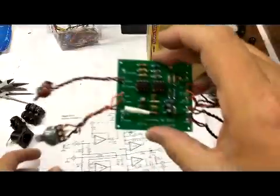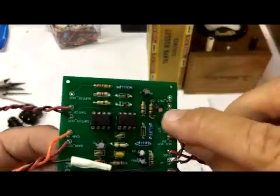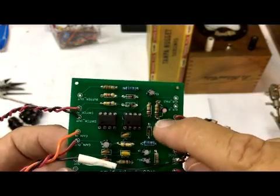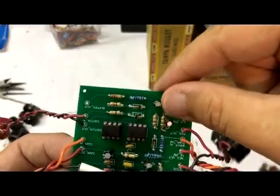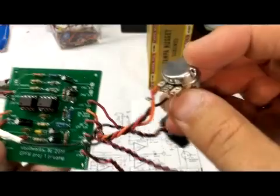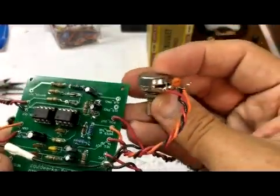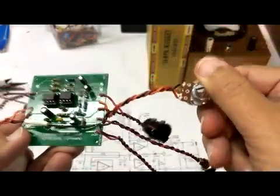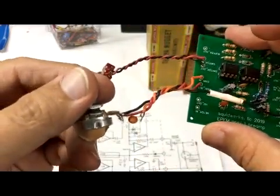Where did I put that on the circuit board? That resistor right there — that leg is ground and the leg over there is the reference voltage. I added these almost anemic little capacitors there. This is the volume and I did the same thing over here on the gain.